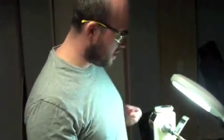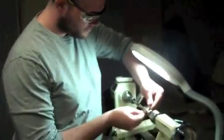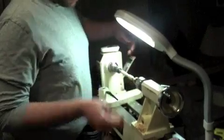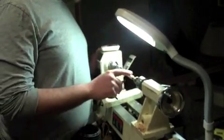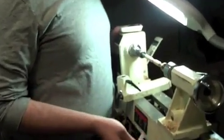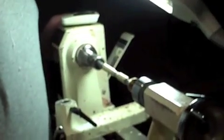So I'm going to get going here, and let's get this thing sanded. Pull the sleeves so that they don't get caught. You can already start to see the scratch pattern in there, but each layer will take care of that. So I'm going to go ahead and take care of the 220, the 320, and the 500. With each successive grit, my pens get a little bit shinier. That brass gets everything sanded. It's down to 500 grit. That's a good spot.